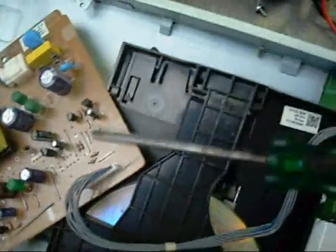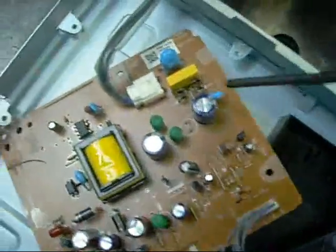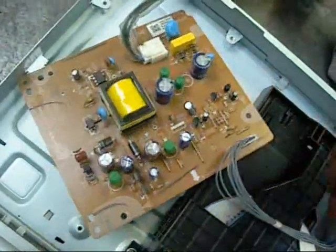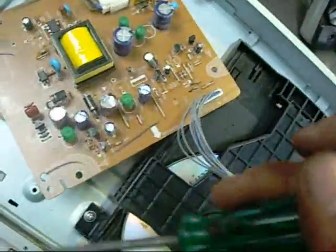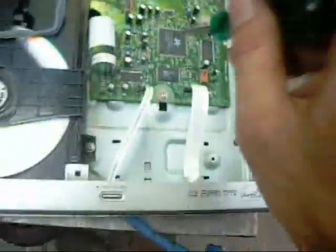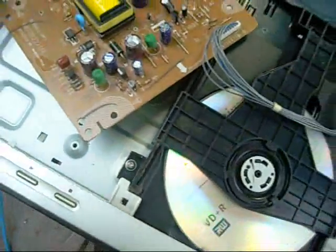Okay, well the only component that actually goes to ground is this one here, capacitor number 110. I can't quite read what's on that one, but it's a high voltage, probably a filter capacitor or something. Everything else on the primary side where there's high voltage just doesn't go to ground. Either that or something's gone wrong in here and it's putting out excessive voltage, but then this probably would fry. Unfortunately I don't have the equipment to test one of these, so it'd be a bit of a guessing game.